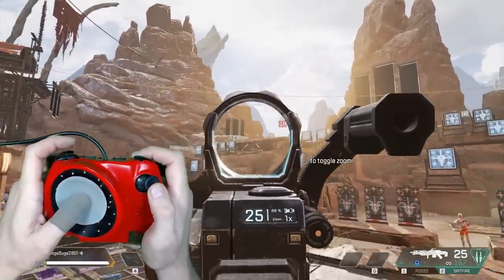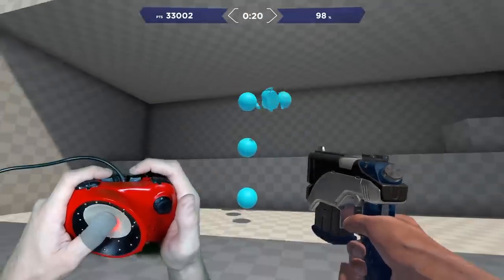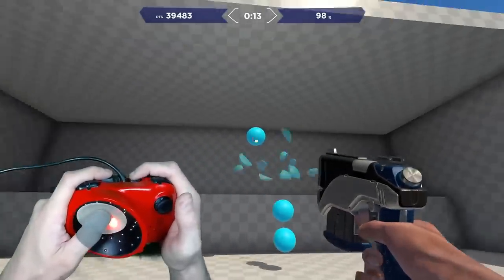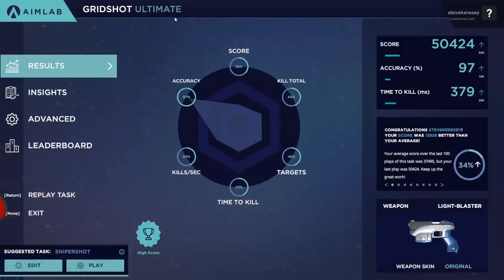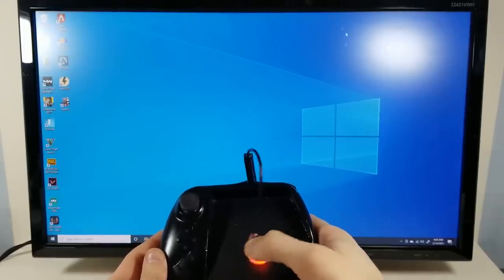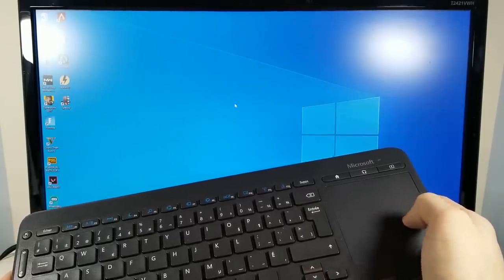One of the major problems we had with the mouse controller project was making a thumb be as accurate as possible. A major factor that got in the way of this was the friction that was created when your thumb came in contact with the thumb mouse pad. This part was quite complicated, as we needed to remove just the right amount of friction. If no friction exists, it will be almost impossible to move your thumb precisely to an in-game target, and you will more than likely overshoot that in-game target.